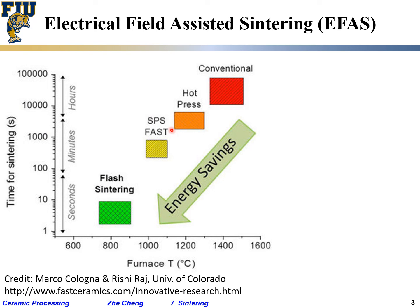And further, people talk about SPS, spark plasma sintering, or FAST, field assisted sintering technique, which encompasses SPS. Now we are talking about we can further reduce the so-called surrounding environment temperature from 1200 to 1000, 1100. And the time we are talking about, well, 300 seconds, which is 5 minutes or somewhat longer. You see what I mean?